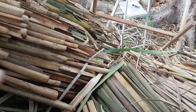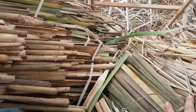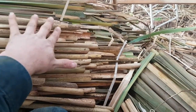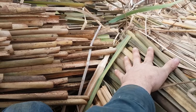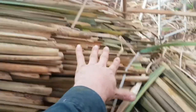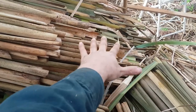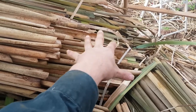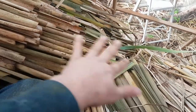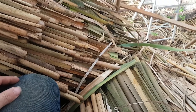What I've been trying to do to get this valley to work is have the courses of thatch from the dormer versus the gable overlap each other, so that when water comes down off one side it'll go onto the top of the other. I've arranged this course of the dormer thatch so that it's coming down on top of this, so what I've got to now do is the next course of the gable so that it comes down onto the edge of this and will actually shed water onto the dormer, which will then go back onto the gable. Getting them to overlap sounds pretty simple, but doing it so the water actually flows from one to the other without penetrating through the gable is tricky.